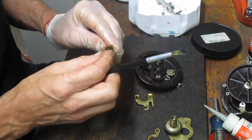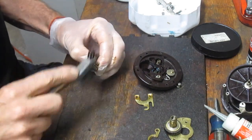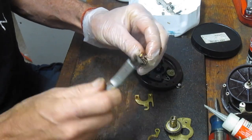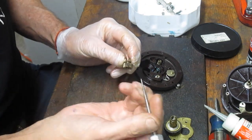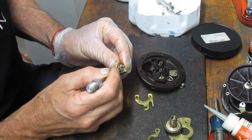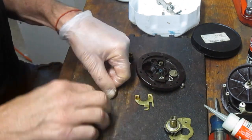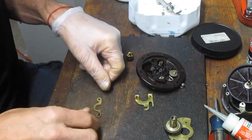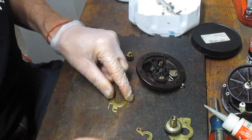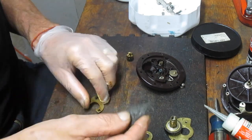I'm going to grab a brush and clean those gear teeth out — I don't want anything hung up in them. I'm also checking the teeth while I do this, making sure it's just discoloration and not debris. If I see something, I have a small pick to run down the channels and clear any dry grease. I'm not seeing anything — it's pretty clean, just grease coloring. There's a little bit of grease sitting on the yoke, so I'll get rid of that using steel wool. If it's stubborn, you can use WD-40, a penetrating oil, or a degreaser like Purple Power to dissolve the grease, but most of the time the steel wool works perfectly.